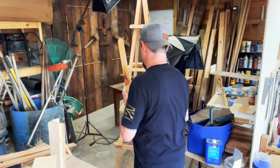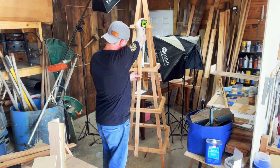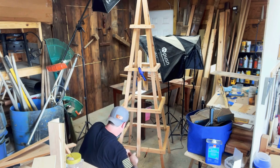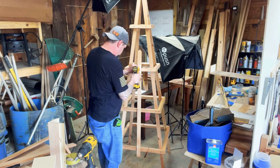And now for the little decorative arrow pieces that we cut earlier, I'm going to find the center of the second square down and find the height that I want, which in my case was about 8 inches, and just clamp that into place. And after finding center of my 20-inch board here, I'm just going to pre-drill and put in a little 1¼-inch deck screw. Same thing for the bottom. And then I'll remove my clamp from the top and repeat the same process for that. And you know the process. Turn, repeat, turn, repeat. And now we're ready for the post cap.